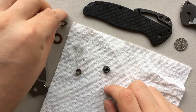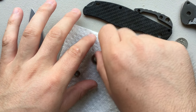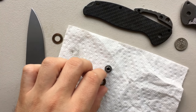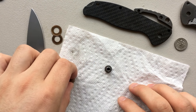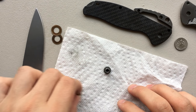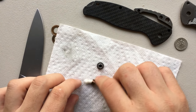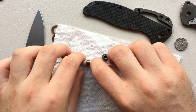This is something that a long-time commenter, a guy named John Tedichuan, always recommends. It's a good idea to go through with maybe a piece of leather and just really strop your washers with some compound and get them super smooth. That's a way you can add smoothness to a lot of knives — even knives that aren't super high-end. If you put the effort in, you can often get a knife even smoother than it came from the factory. That's a beautiful thing, though it's not always possible — unfortunately, some knives just start bad and end bad too.